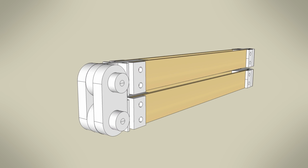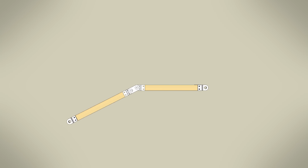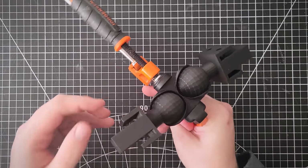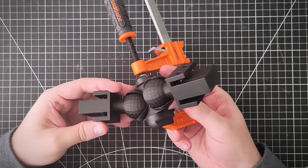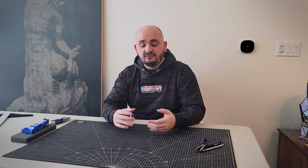And from my exploration, I realized a couple of things with a design like this. The elbows need to have 2 points to tighten to have it collapse back over itself like this to give a good range of motion. I don't really like that, since my design from the ball joint just had one. So I'm literally doubling the work that it would take to tighten down each of the connections to all of the arms. I could not get a design that I liked that had 2 connection points, so I moved down to 1. But like everything, I solved one problem and made 2 more.